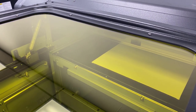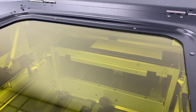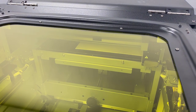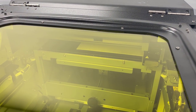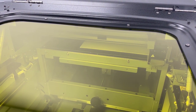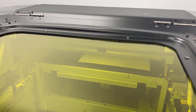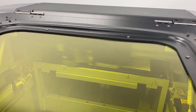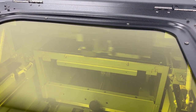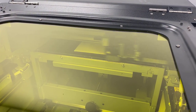This is going to be one pass through the machine, so the print head is going to split into three sections. The first section is the leading section — it's going to be putting down the white, which is our texture layer and underbase, giving us the highs and lows of the mountains and the trees. The second third of the head is going to be the color layer — all the color graphics in the design. And then the last third of the head is going to be that gloss clear, which is going to give us that reflection you saw on the lake when we showed you the design previously.